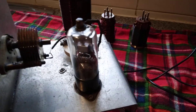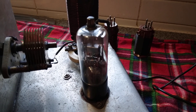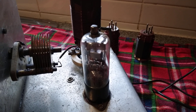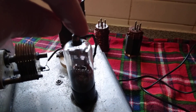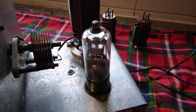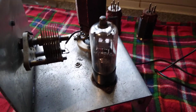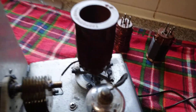The valve is a battery valve, which is a triode. It uses 1.5 volts for the filament, and as you can see the anode is at the top there, which is typical of the old 1930s valves. It's an RCA design. The filament is still intact after all these years, and it uses plug-in coils.